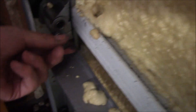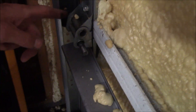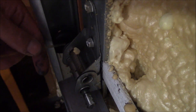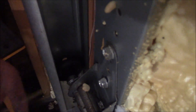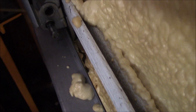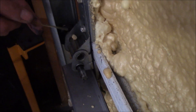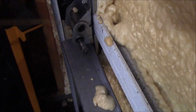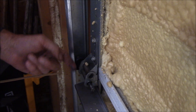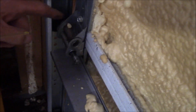Then we have some rollers. A lot of rollers have bearings on the insides and there's a shaft. This wheel, besides having bearings — or this plastic one doesn't — I put two drops of oil on the shaft so that wheel has been lubricated to that shaft. Then I oil the shaft, a couple of drops each side. I do the hinge while I'm here. Now, I put no oil inside the track. I only oil the axle of the wheel, the sliding shaft, and the hinge.